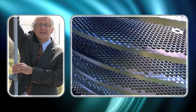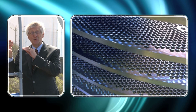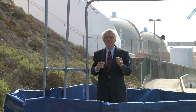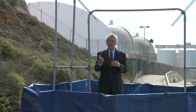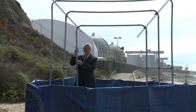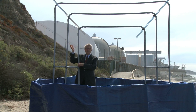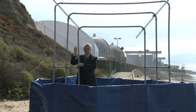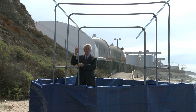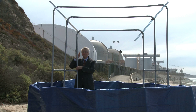The tubes are colliding with these plates and denting, then leaking, and the space I'm in — which would normally be non-radioactive — is becoming radioactive. That's what caused the unit to shut down in January. Radioactive steam from inside the pipe broke through and entered the non-radioactive side. The problem at San Onofre was stopped because they shut down quickly — they were releasing half a gallon a minute of radioactive steam.